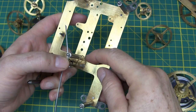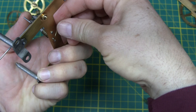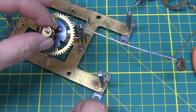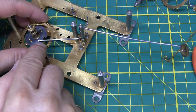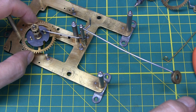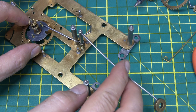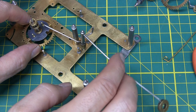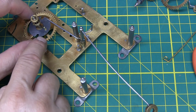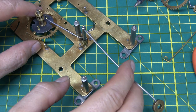The striking hammer goes right there. The wire wraps around this corner and comes down — I just press that in there. This wheel has these two pins and two depressions. What happens is this wheel goes around and hits the striking hammer tail. When the pin passes the end of the striking hammer tail, it's supposed to come back because it should be under spring tension. I noticed it was very weak to begin with — there's virtually no tension on there. So we want it to come back.